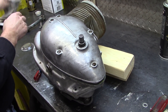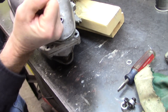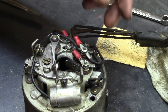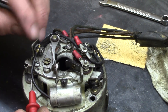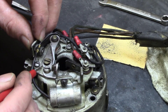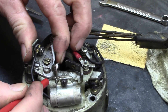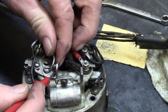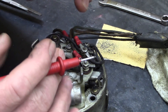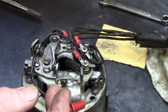There are two pins that have to engage. On the opposite side of the engine, this is where the stator is. We were checking all the wires and tracing them out. The one that goes to the points has to be insulated. Before we were filming, we were checking this — when you were touching here and then touching the ground, you didn't get anything. Right now the points are closed. If I open it far enough it hits that screw. As this thing's spinning around, there's 12 volts going to it. When it opens, it collapses the field and then it goes to the coil, ignites the coil, and makes a hotter spark to fire the spark plug.